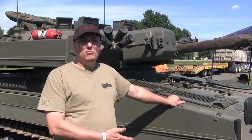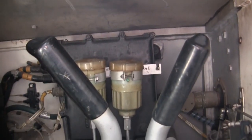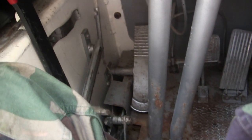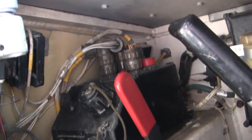And the other thing is too, these would sit on the firing line where your gas pedal is inside. There's a linkage with a wing nut. They crank the RPMs up to like 4,000 RPMs and put the wing nut down. That way they weren't using off the batteries on the firing line. So these motors in the military were treated pretty harsh.